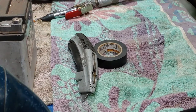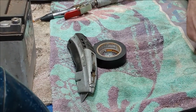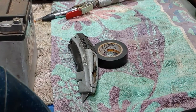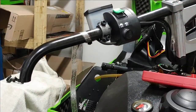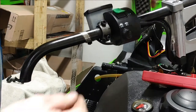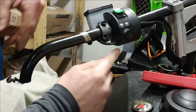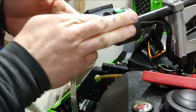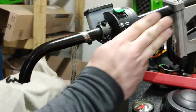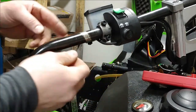The next thing is to go over to the sled and get this thing put back on. So we're getting ready to put this heating element on. The first thing I did was slip this wire through the slot that's down here. If it doesn't seem like it wants to fit, just move the wires around until they go from bunched up to flattened out, and then you can slip it up in there and pull the whole thing through - that way it'll brace it while you're putting it on.